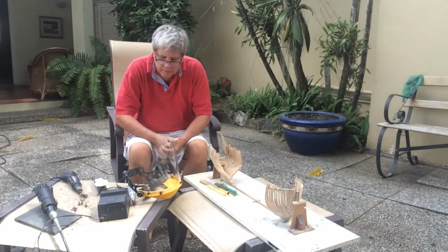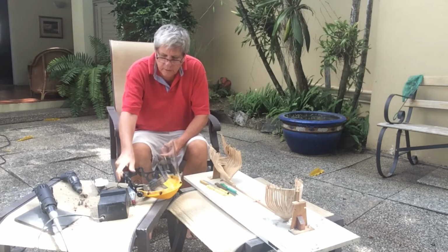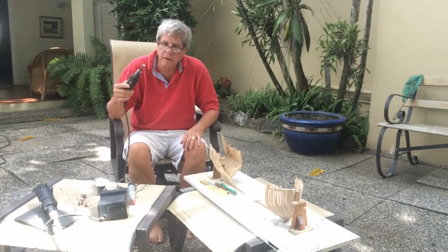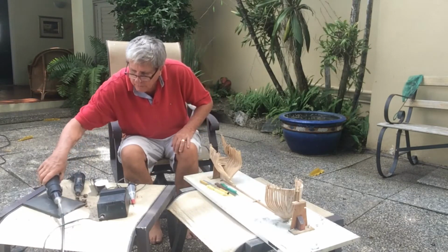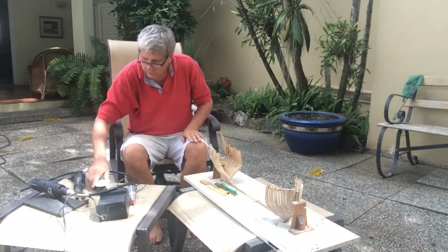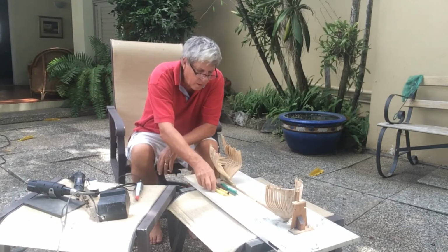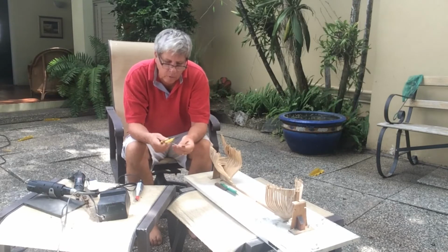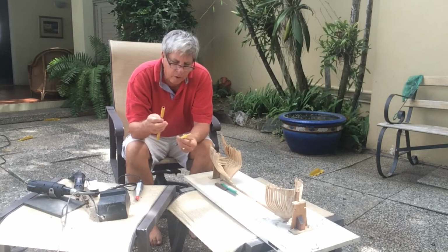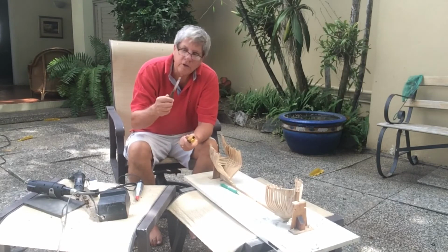Today is the cleanup day. So we have a lot of tools here, not necessarily because we're going to use all of them, but that we want them all available. First, the dust mask, the Dremel with the drum sander, which takes a lot of the bulk stuff down. And I have this, which is very useful for getting inside, the disc sander and the little Microlux saber saw. But more importantly, on the other side, as it starts getting down closer, we'll go to all the hand sanding tools, a flat, a round, these little ones that I got years ago, a file, and not to be forgotten, my nice sharp chisels.